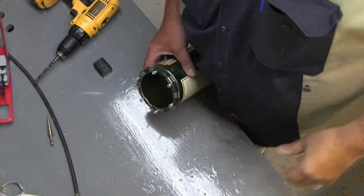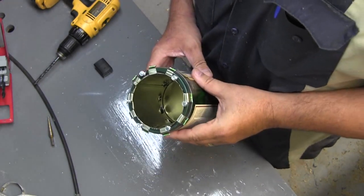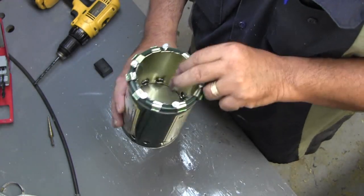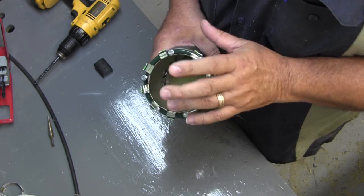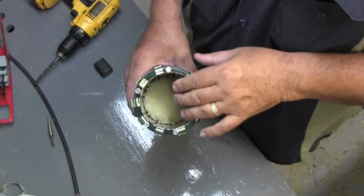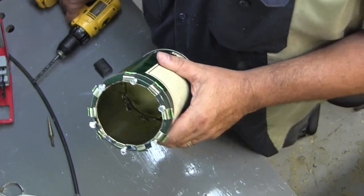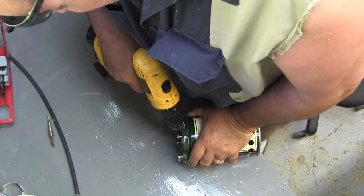Thanks for watching. I forgot something very important on this wood gas stove, and it's probably the most important part. And that is the holes that go around the top edge of this. That is really important because what happens with the holes in the bottom of the can is the wood, when it's on fire, creates several gases, but two of them are volatile and flammable. It drafts down through the bottom holes and comes up in the gap between the inner and outer can, and it's supposed to come out these top holes, but I haven't drilled them. So rather than try to take this apart, I'm going to see if I can drill them at an angle, and yeah, it's going to work.